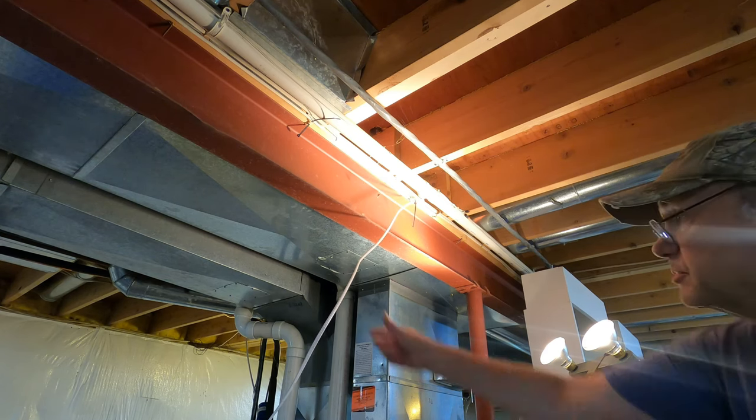The relay has arrived and it's time to get busy with installing it. This thing comes with two long screws that you could use to screw it to the cabinet on the inside somewhere if you wanted to. I don't want to. I think I can probably just stick it to the bottom with double-sided tape and that'll be fine. It also comes with a half-inch threaded nipple and lock ring for a standard half-inch knockout, so it could be sticking outside of the box if someone wanted it to. I don't see any reason for that in this case.